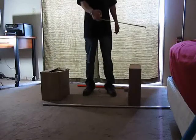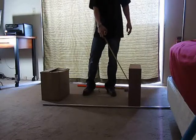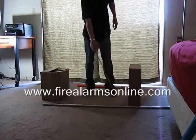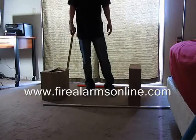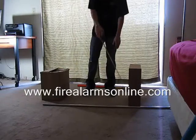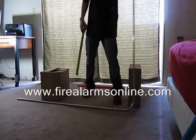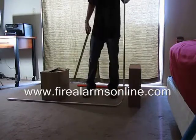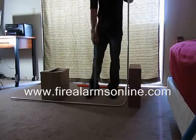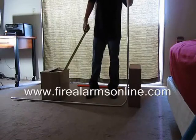With that said, we already have one 90 bent, and we're going to be going from — this would represent a wall, maybe across the ceiling if you're looking at it upside down, and down another wall. If you had two devices mounted like this and had to do the U-shape, we call it a back-to-back 90. We've already got one 90 here, as you can see it lines up, but we're going to want to make another 90 in one solid conduit right here.